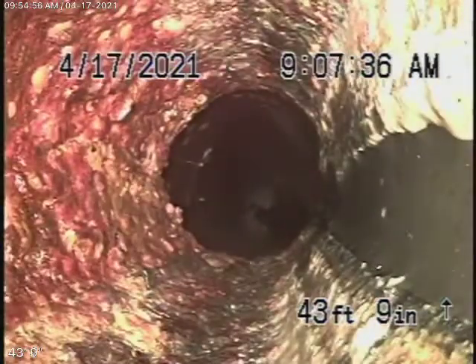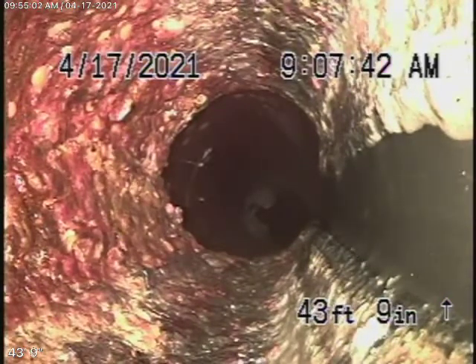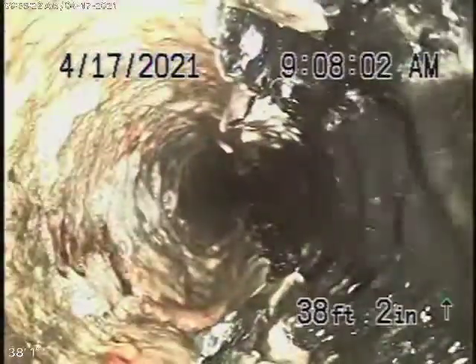So here we go from a clay pipe four-inch to a cast iron pipe. This is the original cast iron pipe underneath the house. We're going to have a good look at it coming back. You can see it does have some rust buildup and minor grease buildup, but it's still round and looks like it's in pretty fair condition. Probably needs a good servicing. Wouldn't be a bad idea to put a two-way cleanout when you install the cleanout in the front, so you can service the line going upstream. Worst case scenario you can always run a blade through this three-inch cleanout on the side of the house.